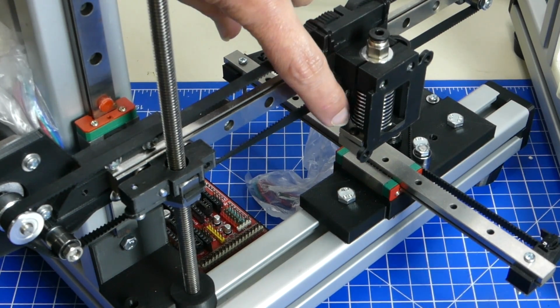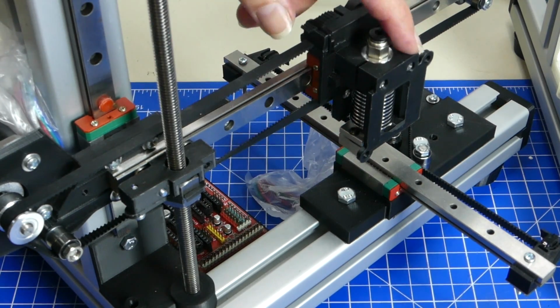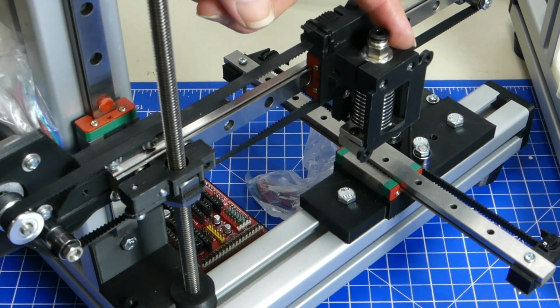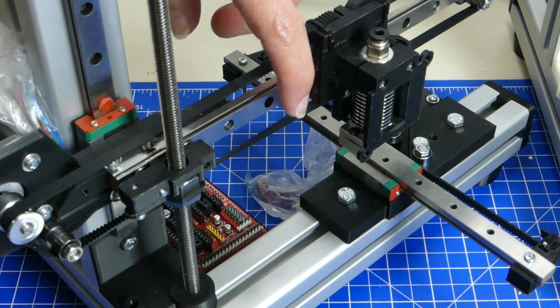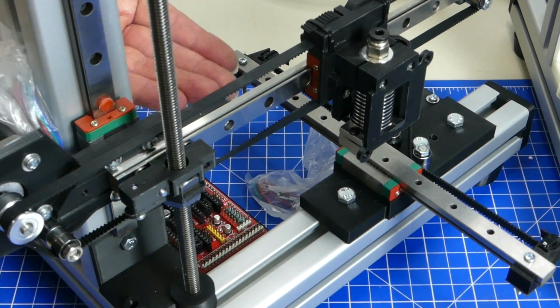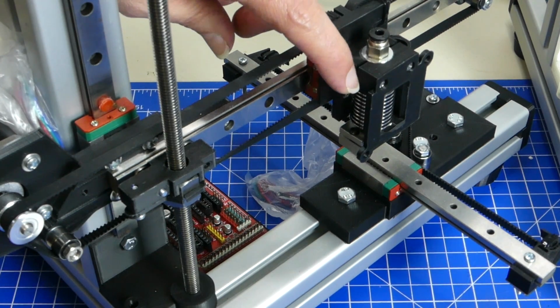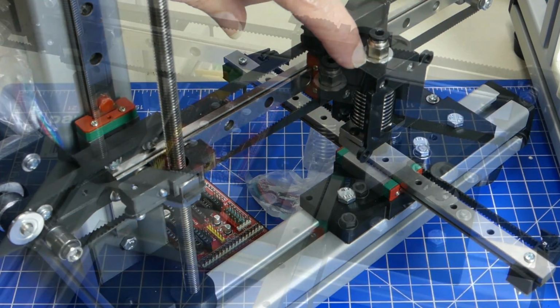And lastly, the extruder assembly is extremely light and only features one fan, which is responsible for cooling the extruder and also cooling the print. The fan is speed controlled by the firmware, sucks in air at the side and expels it over the print at a very high speed. This makes for very efficient cooling of the print and the extruder, and it keeps the weight very low.